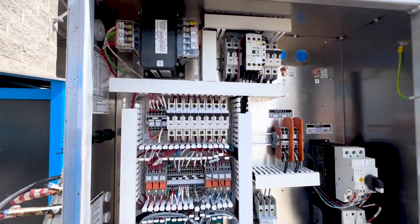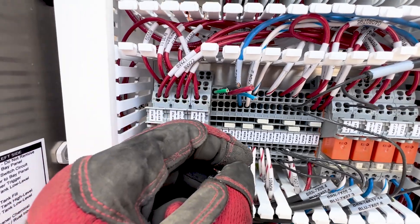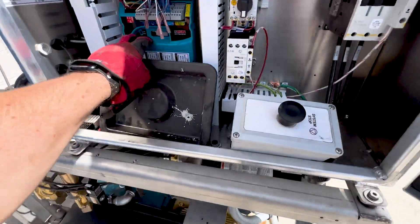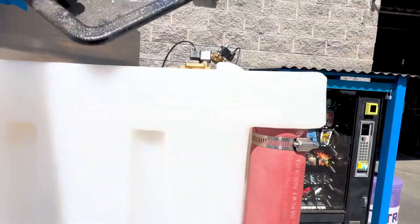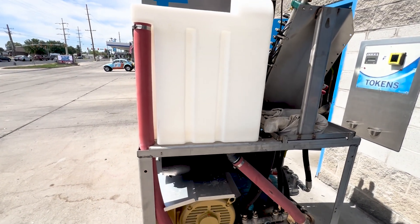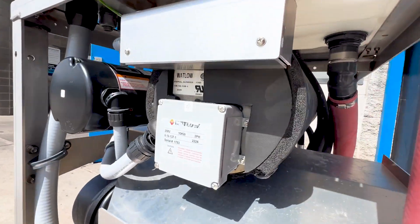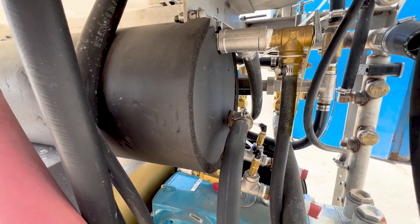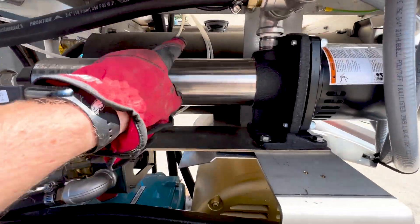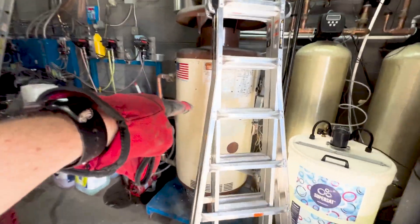And then there's the cabinet of electrical. You can see the guy who removed it cut some wires here, but I trust that the guys installing it have done enough of these and know what they're doing. This cap here is for the tank up there — it stores water. I'm not sure if it stores spot-free water or high-pressure water. The reason there's insulation on this cylinder is that it's a pump and a heater in one. Something unique about this machine is it has an onboard heater for its pre-soap, and then I believe that's the spot-free pump — all packaged in one nice unit.